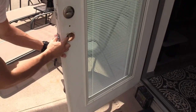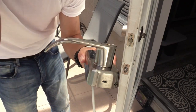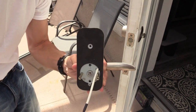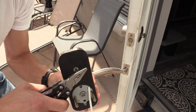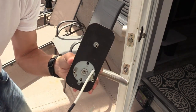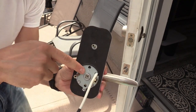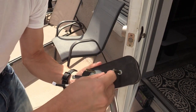Make sure this piece is upright and centered. On the bottom there's a speaker and a micro USB port — so if it runs out of power you can plug in power and access the keypad that way. Put these on fairly tight because when you put the screws in you want everything to fit nice and tight. Do a one-and-a-quarter turn, make sure it's snug — don't over-tighten, about a one-eighth turn. Now you have this piece with the hole in it, and you want to line it up with the hole on top, then slide the lock pin down right in there.